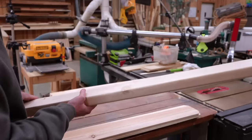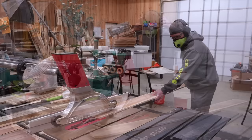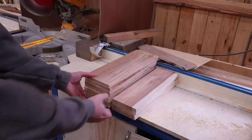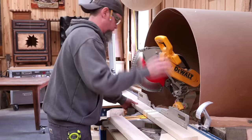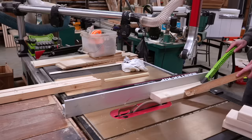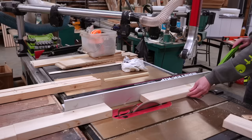For this build it's going to take one two-by-four and four 72-inch fence pickets — I know I'm only holding up three here but trust me it takes four. I'm going to throw on my RZ mask and hearing protection and get to cutting. The full cut list will be in the description, and if you're a plans-in-hand type of person I'll throw a link in there as well. I've already cut out all the fence picket parts, so now let's move on to the two-by-four — cutting lengths before ripping them down to reduce any bow or warp.